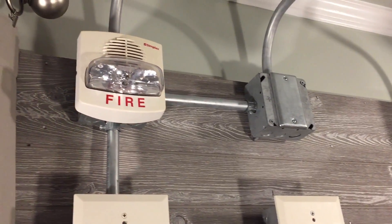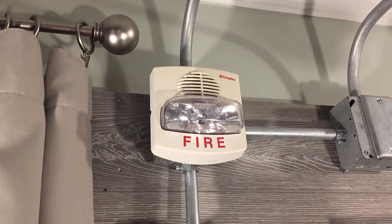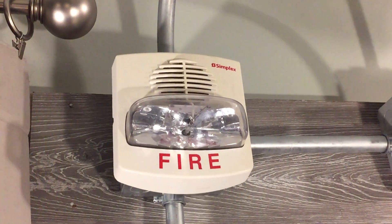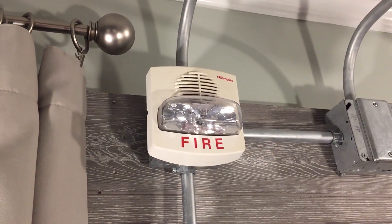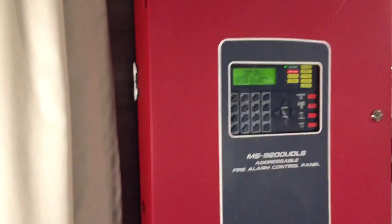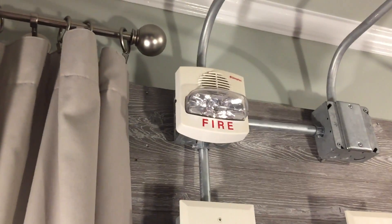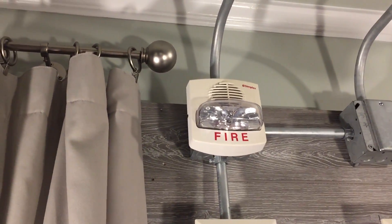For the notification appliance I just have one today because I don't have anything else that's modern Simplex. Well I do but I can't use it. I have my Simplex Quick Alert — not a True Alert. These came before the True Alerts. It's free run and it's in white, on Code 3, and the strobe I believe is on 15 candela, it might be 30. I did something with the panel so when this system activates the strobe will be going off for a second then the horn goes off, so it kind of resembles a Simplex panel.